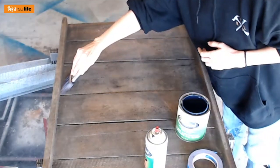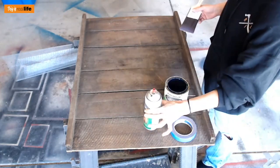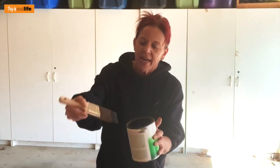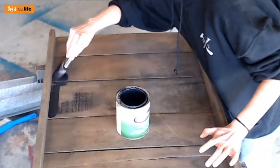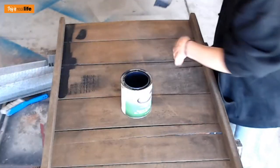I have what's left of chalk paint and some chalk spray paint — both by Rust-Oleum — and I'm hoping I have just enough. Every time I paint, be it walls in the house or whatever, I do not tape anything off. I just cut in by hand using a nice angled brush. I did bring out the tape just in case, because there's not a lot of chalk paint left. Chalk paint is pretty easy — it's just like normal everyday paint. I'm going to dip in, cut in first, get the paint off one side of the brush, tip it, and run it right along the edge.